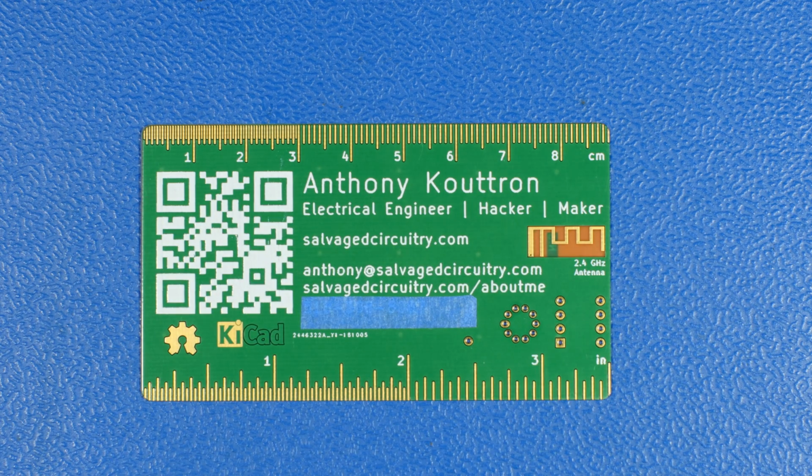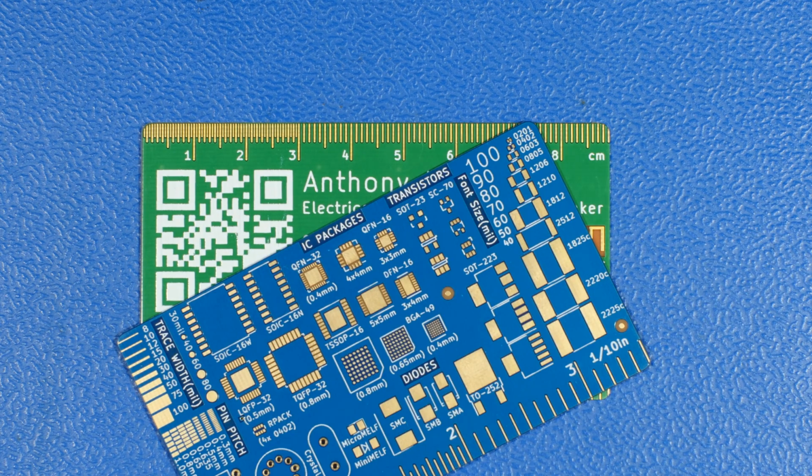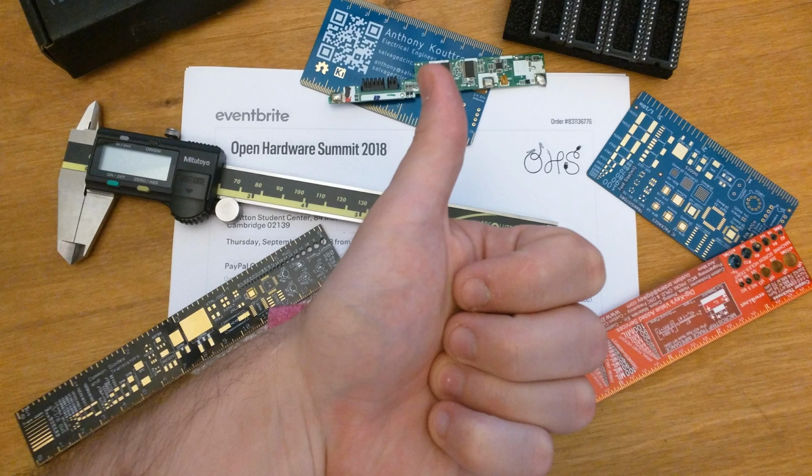The interesting thing about designing PCB business cards is, sure, you can use them to network, but you can also use them to test out different PCB vendors. Because there are so many tiny, intricate designs, I use them like reference cards to measure solder mask pullback tolerances, silkscreen consistency, and accuracy of copper pads versus pullback. These cards were a joy to use at conferences and events.